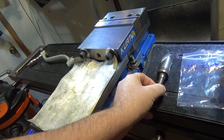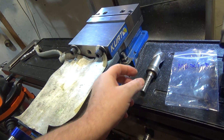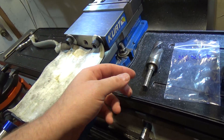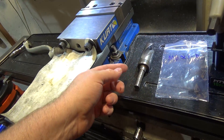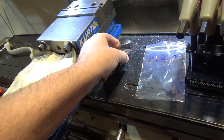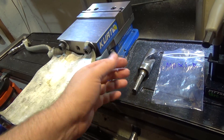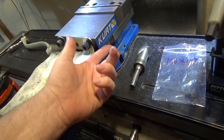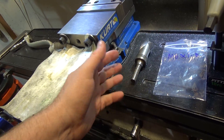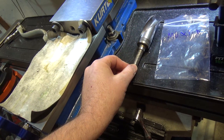A little bit of trivia here: Silver and Deming bits — most people have probably seen them — have a half-inch shank on a much larger size bit. I thought 'Silver and Deming' was the name of the process or what they were used to cut, but I had no idea what 'Deming' was. When I looked it up I found out that Silver and Deming was a company from the 1890s — two guys' names. They're just a reduced-shank drill bit, good for alignment because their shanks are cylindrical. If you get too much torque they're supposed to slip, like this one obviously spent plenty of time doing.